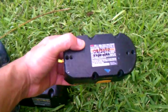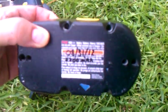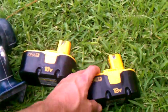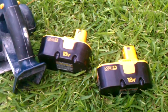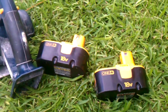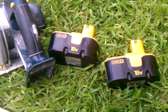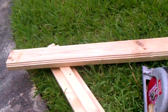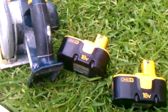We also have the new rebuilt battery that I just made. You can see it was done on August 31st — it's 2,200 milliamp hours. It's been about three days since these batteries were fully charged. I really just ran them on the drill to see how fast it would spin, and cut some 2x4s a couple times to see what would happen. But let's go ahead and test them out.